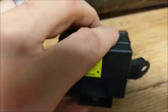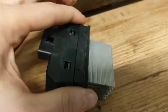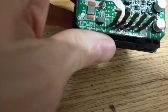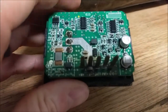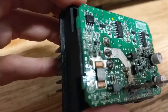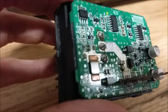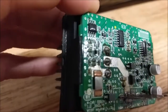Just a couple of tabs, one there, one there on the other side — let's pull this guy open. Now let's take a first glance here. There's a conformal coat that's sprayed over all the electronics; you can especially see it by these pins. That's to keep any type of water or moisture away — you can even see the glare, it's got a weird waxy look down in the light. That's to protect all the electronics from condensation and water.